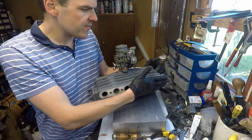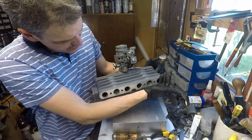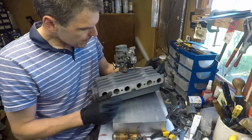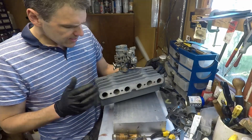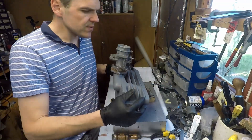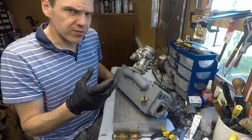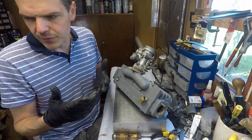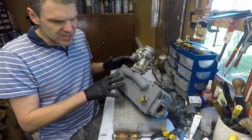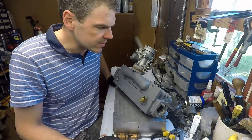A couple of things I had to do to this manifold off camera: I had to skim this side so that I could get a surface that was going to seat properly. That was quite important, but it's been done. And as you can see from the first video, I painted it with gray oxide primer. The reason for painting gray is because the color of the manifold is quite a personal choice for the user, so it's important to keep it as neutral as you can, and then the owner can put whatever color they want on it.